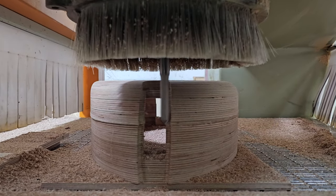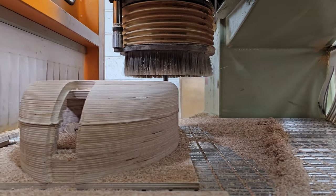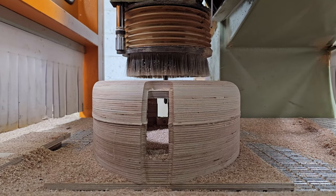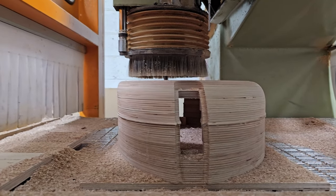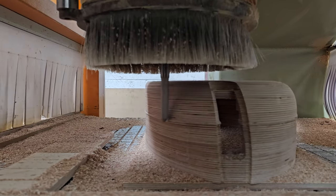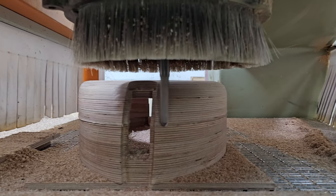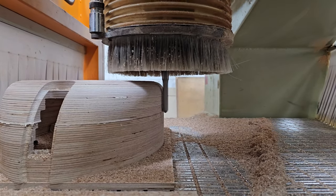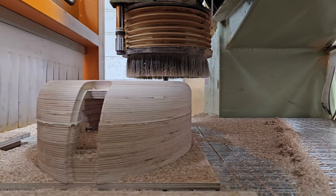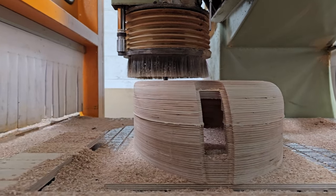When you're metalworking, good chip formation is also important because you're thinking about pulling the heat from the cut out, and the chip almost kind of wicks away that heat, and again pulls the heat away from the carbide. Now potentially there'd be an air blast or mist coolant or flood coolant as well if you're metal cutting, but obviously with woodworking we can't do that.